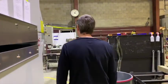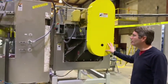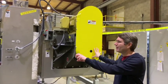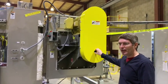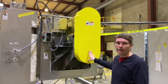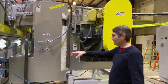Let's go to the back and look at the burners. This is the start of the burner system right here. This is the supply fan — this is the heart of the dryer. It does all the pumping of the air to support the web across the air bars. It produces airflow that can go up to 8,000 feet per minute, so it will produce a lot of air pressure. This is a 40-horsepower motor to do it.